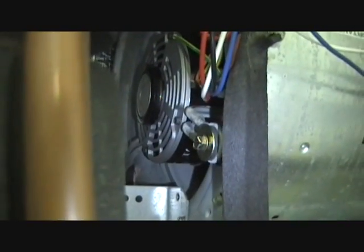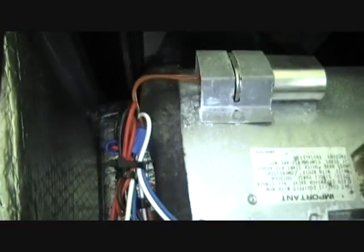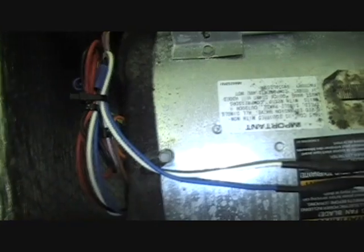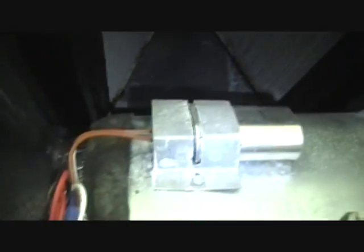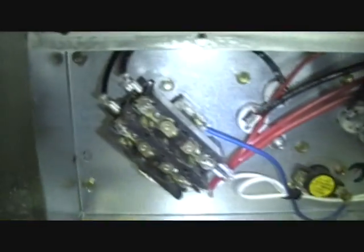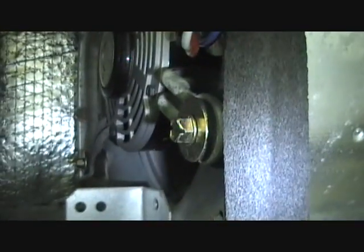Our blower motor is running. We have our speed wires - the ones we're not using, high and low - bound up up there in case you ever need them. Left a little bit of length on the wiring. There's the two black splices for L1 and L2. There's the fastback connection - comes in a little lighter, like most replacement motors do. A good kit. Everything is pretty good in there. As long as we have our unit coming on as needed, we're good to go.